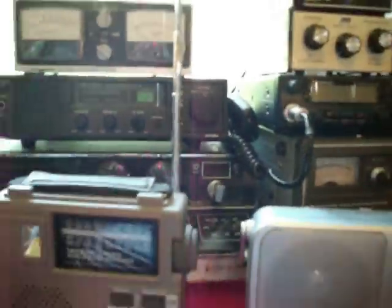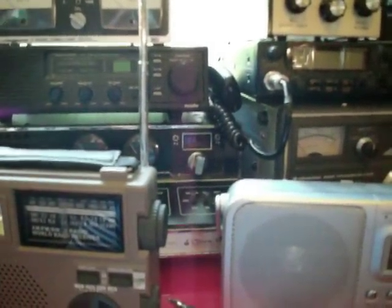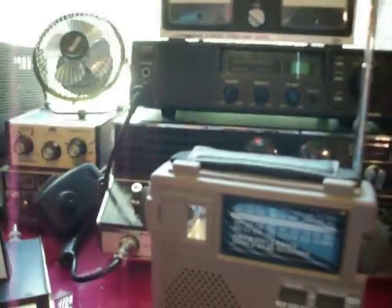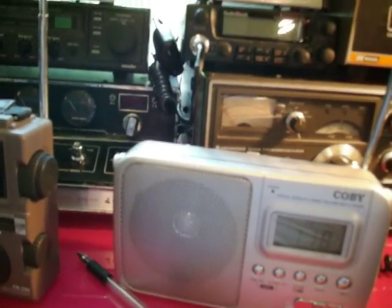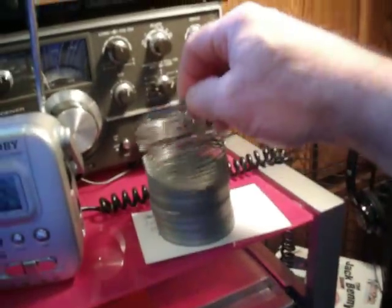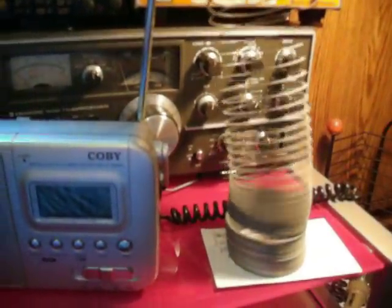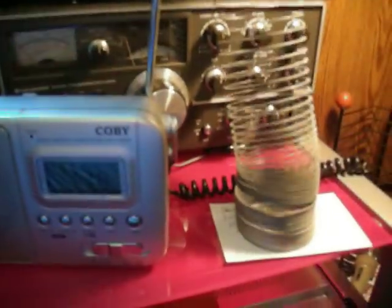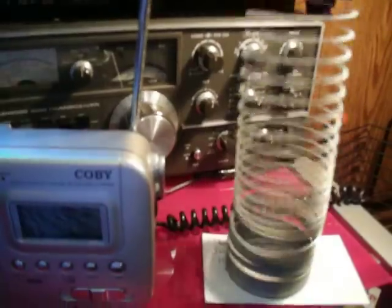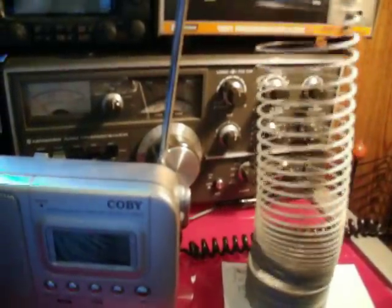You may also not want to use just the vertical antennas that are on some of these shortwave receivers. I have two of mine — the DX392 and the WorldStar — hooked up to outside antennas. Or you can rig up an antenna on the inside of the house, fairly simple. If you want to put something inside the house, you could use something like a slinky antenna. You could put it up on a window rod or just about anything — vertical or horizontal. If you put it horizontal, it gives you less noise than vertical.